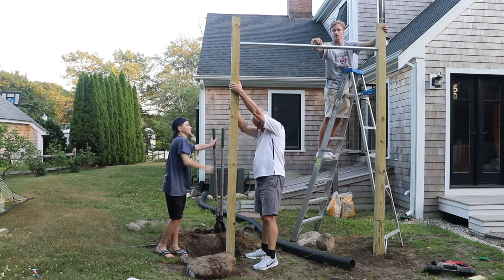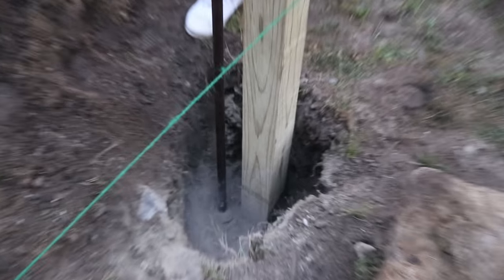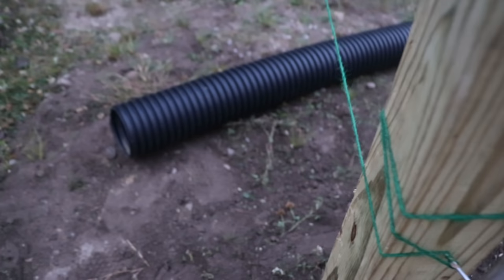Check the level. Tap the cement. Same process on this hole as the previous one. Here's the string — it goes to that string bar over there in a straight line. You want the post right up against the string — boom, straight across there.